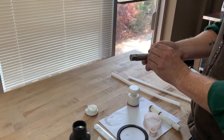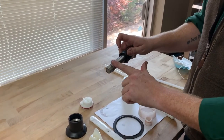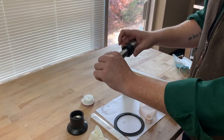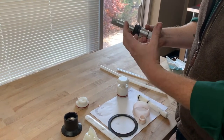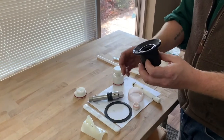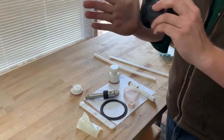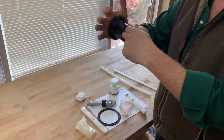The Taylor ones go on the drive bolt, and you put lube into here and then to the end here, and you don't put lube on the hex head. This is your first line of defense in keeping the inside mechanical part of your machine from being damaged by product. On Stoelting, they use a rear boot seal, so this presses against the rear of the barrel and creates a suction, and then this goes through the auger right there.